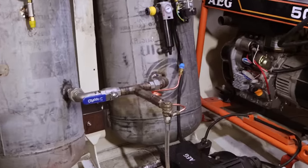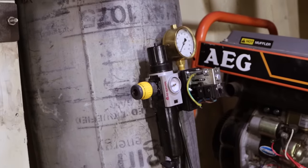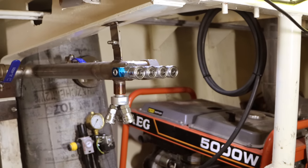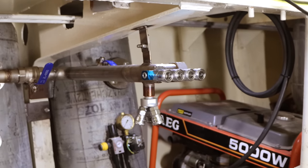I was left alone for three minutes staring at this thing and I've made some changes. I've got rid of the four-outlet connector for the regulated air supply and just changed it with a single Nitto fitting so that it's stronger — I don't have to worry about bracing it. So now I've got seven unregulated air supplies — quarter inch and half inch. In the eight years of building this boat, I can think of one situation where we had to try and reduce the air pressure and regulate it down, and we did that at the machine we were using — spray painting using the pot as the regulator. So I think we're almost never going to use the regulated air supply. That's why I thought let's ditch that and have more unregulated outlets. It's quarter inch BSP fittings — if we need to change it, we can just change it.